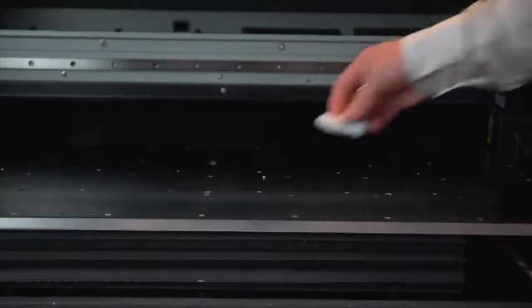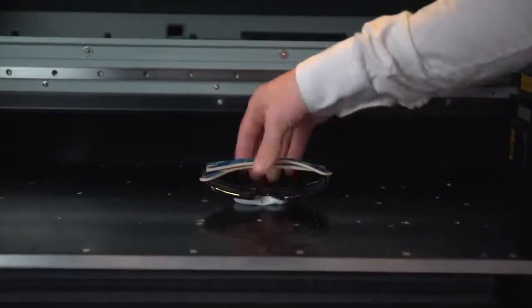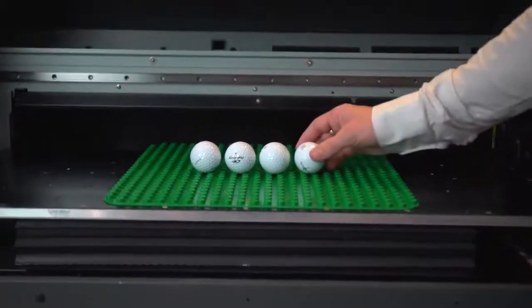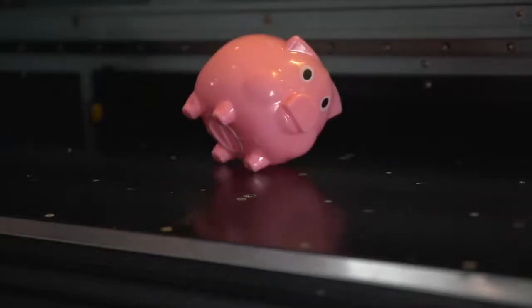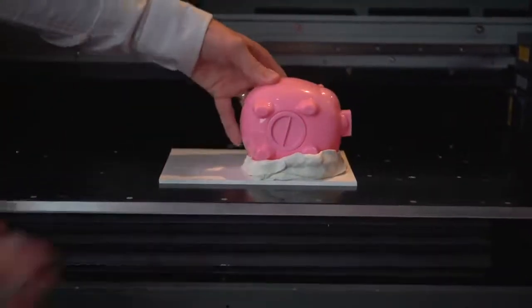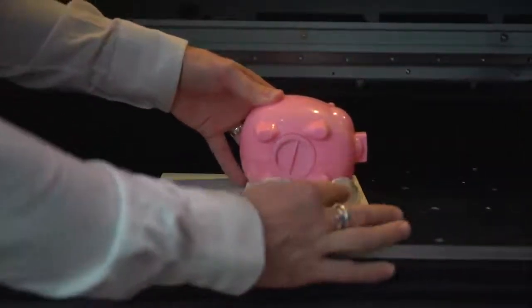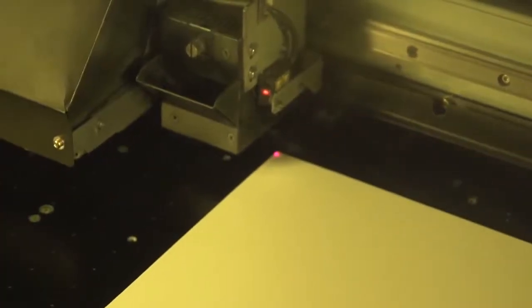Now let's look at some of the more basic and conventional options. For example, you could use blue tack just to hold items in place on the bed, or use a duplo panel to print your design onto a grid and align the print as already seen. For spherical items you could use bottle tops or an empty egg carton. For a really complex shape, you could use some modeling clay or similar with cling film on top so that the item doesn't stick — just press your item into the material, place it where you want on the bed, and use the center position alignment option for the laser pointer.